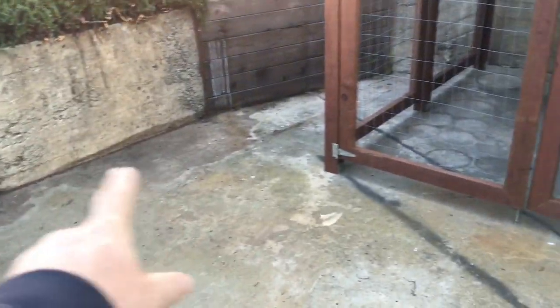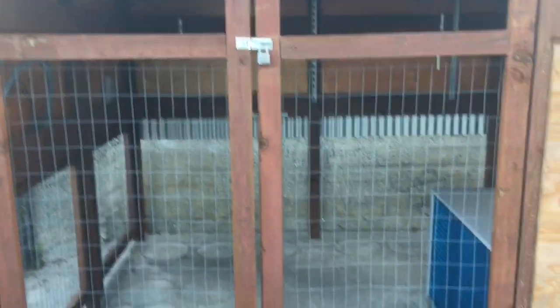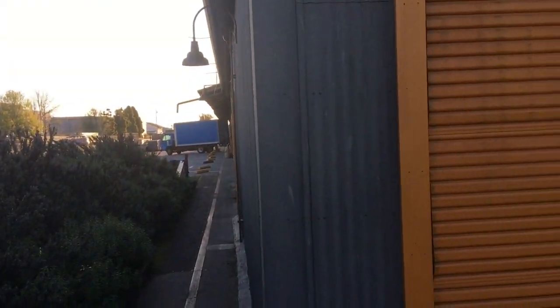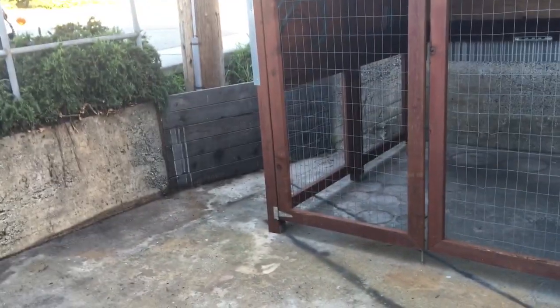It's pumped down and cut away. In order to get this thing out of here, we're gonna move the condensing unit over to here and the chiller tank in the back with the glycol. I'm not sure if I'm gonna run the line set out and under and up — haven't figured that out yet. The control panel is gonna go on the wall right here. You can see the glycol lines are already run, and they go in the trench all the way across the building. So that's what we're getting into — moving the glycol chiller.